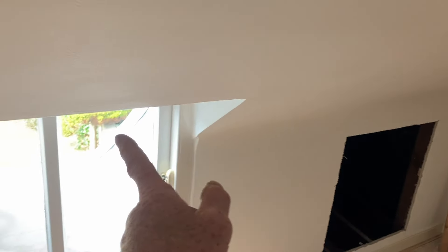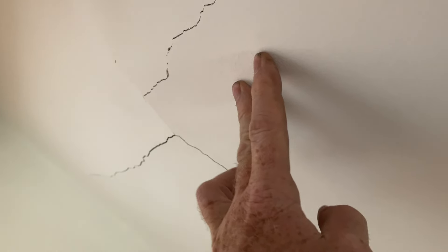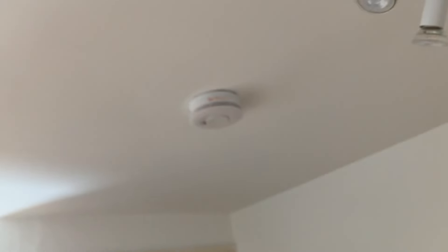This was lath and plaster but it's now been replaced with plasterboard, so the back of it is nice and smooth. Once I get in the attic I can push the insulation down as far as I can, trying to insulate the sloping part of this roof as well — that way it will give it a nice cozy room. I'm not going to be able to get to this part though — this is definitely lath and plaster and it's about to fall down. Whilst we're in the attic we'll be able to get to this part of the room as well, and these sloping ceilings — hopefully it'll be plasterboard.